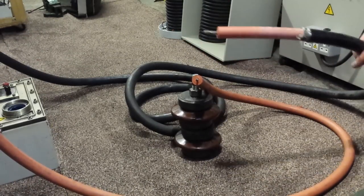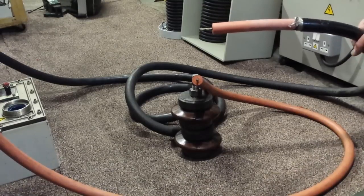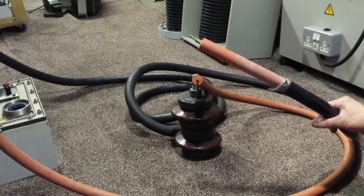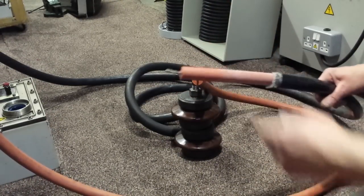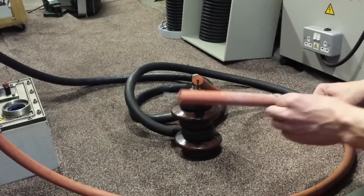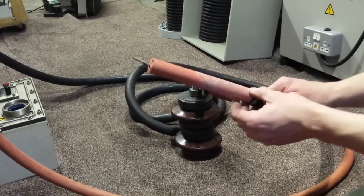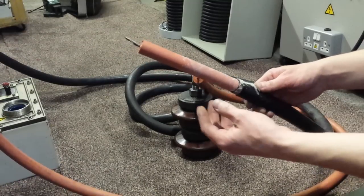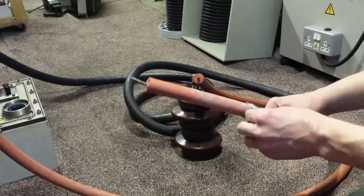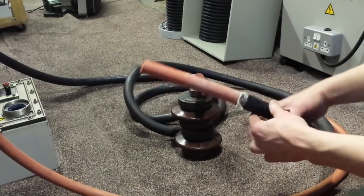What I'm doing with this is I wanted to basically draw some arcs and take some pictures, but I thought I might as well do a video from my archive and collection, and just tell you a bit about this 200KV. As you can see, I've got this orangey-pinky inner wire, and it's covered in a wax, and then around the wax is coated with this black wrapping. Basically what this wire is on the outer is to take any static away from the actual outer of the insulation straight to ground, and then of course this just covers the outer insulation to protect anybody's hands from touching it.